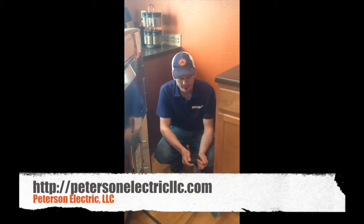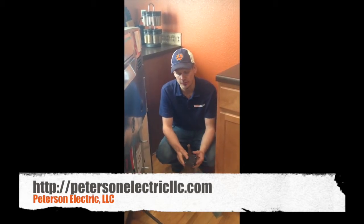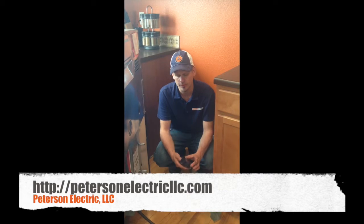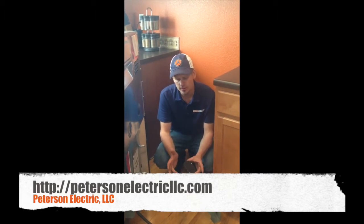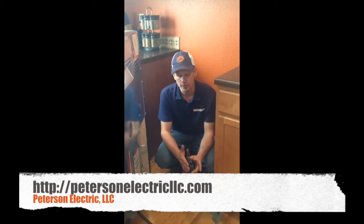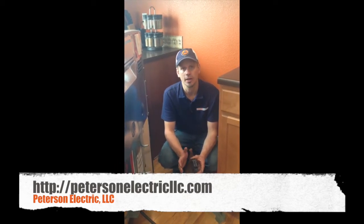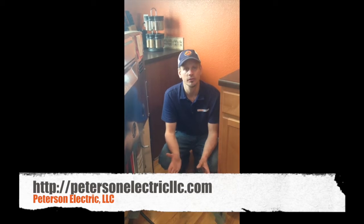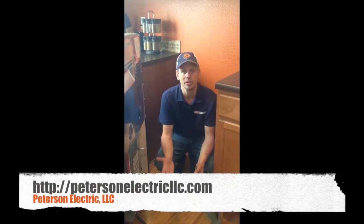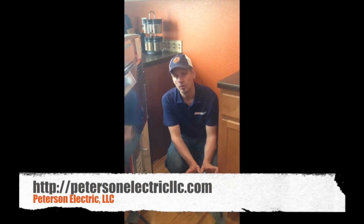This breaker had a little bit of issue with tripping and it's only about five years old. I didn't see any water damage in the panel. GE slims — in my opinion — I've seen some of them get kind of crispy on the side. When you put your breakers in a panel, you never want to use your range breaker next to your air conditioning breaker in these slims, because your AC can run six to eight hours if it's hot out, and your range can run from an hour to six to eight hours on self-clean. If you've got two breakers running a lot of heat next to each other, one of them is going to give out.